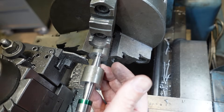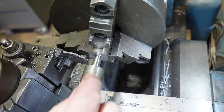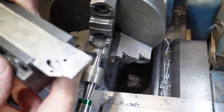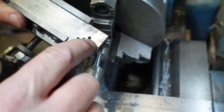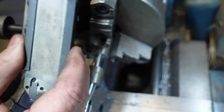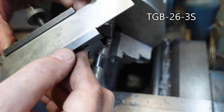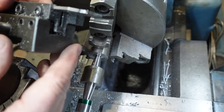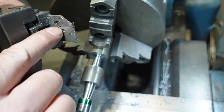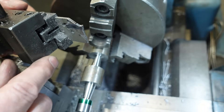There's the pre-shaping of the handle — what you call them, spindles for the balls to go on. To get the final cut in there I used what is normally referred to as a parting tool. This is actually a Tago Tech thing, designed so the blade sits on a V and can cope with some side forces. I got this from my friends at General Tools — no sponsorship or anything — it's the TCB 26-3S I think. Quite a nice parting tool; the blades are actually reversible.